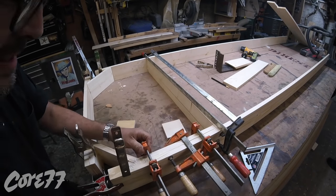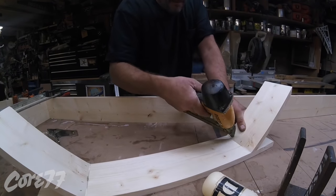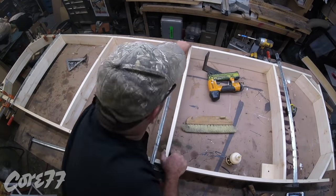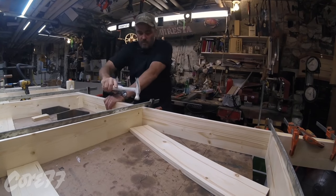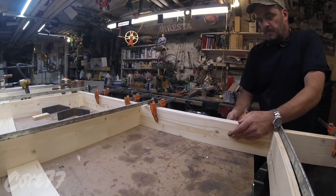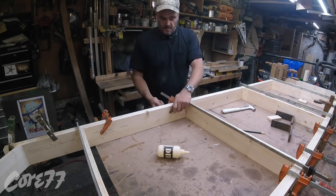Now you see the corner brace is trapped by two pieces of wood. I'm matching all the angles, and now this is going to be the other end of the apron. I'm confident now that I tested the other side, so I don't need to use my little pieces of wood anymore. Everything is just glued and clamped. Then I'll start filling in all the voids around the two long sides with extra pieces of wood. I'm trapping everything in layers, and it ended up becoming extremely strong — once all those glue surfaces dried and with snug fits and things pushing against one another, it helps tremendously.